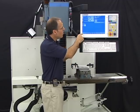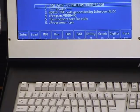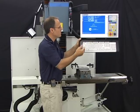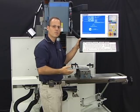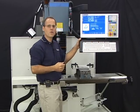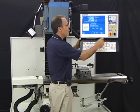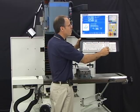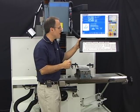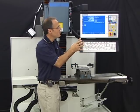To get into the menus, underneath each tab is an F1, F2, F3 button corresponding to the function keys on your keyboard. To go into the setup menu, I hit F1. Now I'm in the setup menu with more choices — F1 for part setup. The arrow keys move the yellow cursor to enter values. The escape key backs up one menu at a time. It's that simple to navigate through the control.